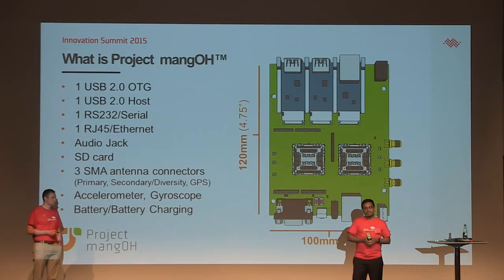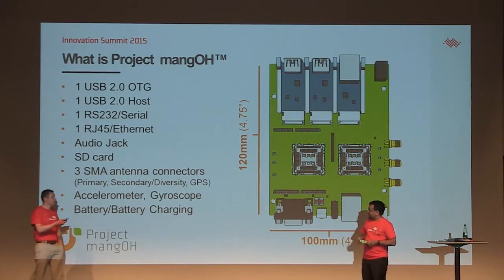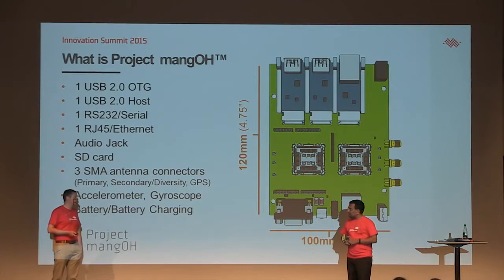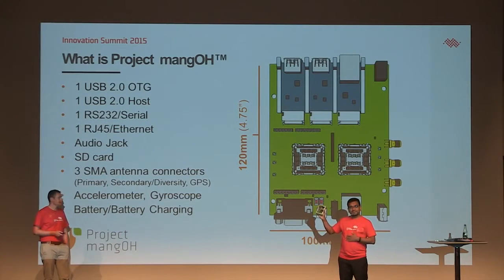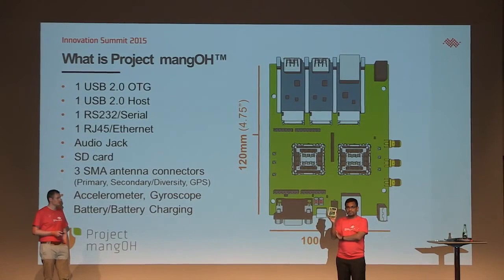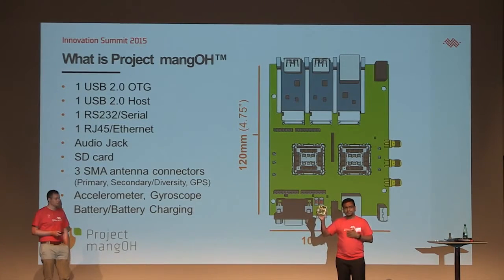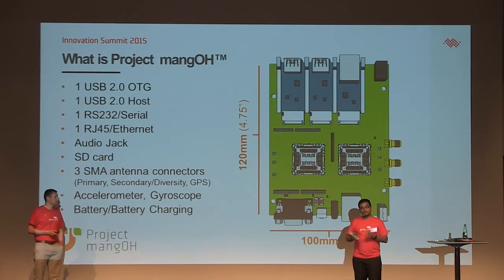We are trying to give this to the community to go forward, to build applications, and help others as they go along. And I think too, the ultra low power that was introduced in the next gen WP series, along with the battery charging, right? These devices go out in the field for years. Exactly. One of the things, which the battery here is giving an example of, is you can imagine you put the battery on this with the 2 microamps of current that WP has today. You can have the battery running for a very long time. In this case, you can drop it into even a remote area, maybe connect it to a solar panel, or even let it run. I think it's going to last 5 to 7 years just on the battery. And you can be gathering data, sending it back to the cloud, depending on the application you're trying to do.